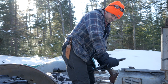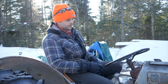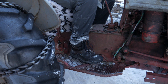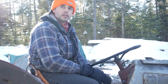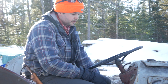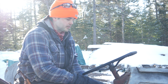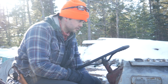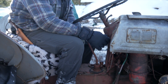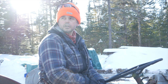A lot of these tractors have been jimmy-rigged different ways, but this one is fairly straightforward. We're on a bit of a side hill, so first I'll put the clutch in, put it on the brake to make sure I don't roll forward, and put the transmission in neutral. It's a little cold so I'll pull the choke out. There's an electrical switch on the left-hand side that needs to be on — that's something we've added. Then the starter button's here. Starts up pretty good.